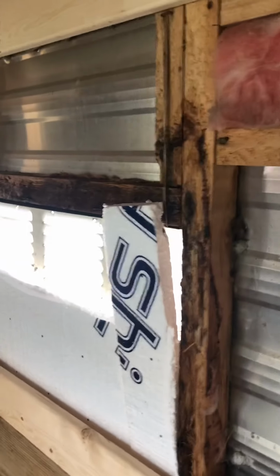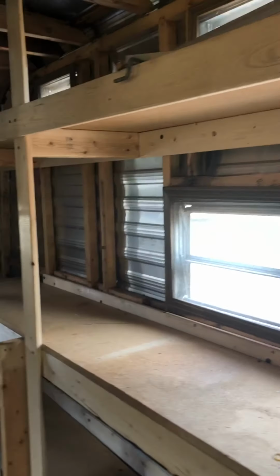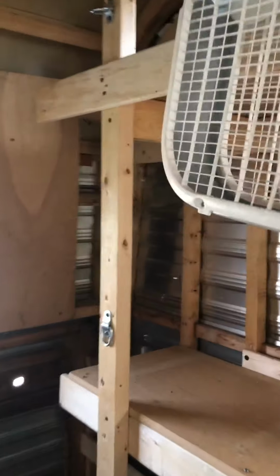Now, the other thing is, what people don't realize is the corners are the weakest part, and anywhere there's a vent. So there was a corner right there. See? Corner. But what I had looked into was using a process that they use to restore antique wooden boats, which is essentially using thin epoxy and a hypodermic needle to go into all of the structural places, all the places that were hard to duplicate, like the curves, and reinforce and harden them with epoxy, so basically they become like a rock. They don't turn to mush like wood does. So you can see that's all that stuff.